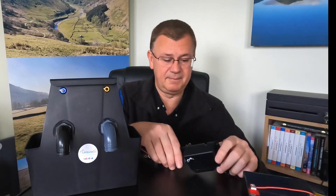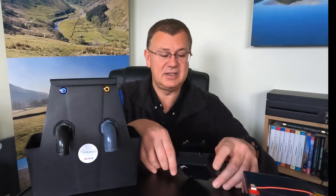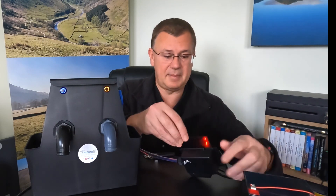That gives you a little bit of a view of how it works. The power consumption is really light — this is what I like about these valves — because once they've transitioned to either open or closed state there's negligible power consumption, if any. The whole thing in standby is using about 30 milliamps, but in the next iteration I think I can get that down to probably under 10 milliamps, because within the prototype it's driving a couple of LEDs that, once the cover's on, you can't see anyway.